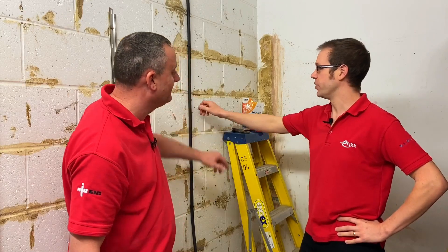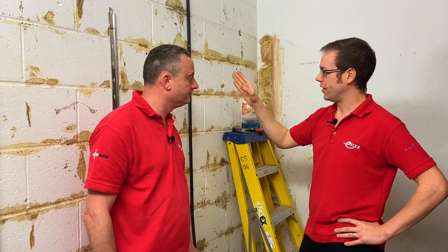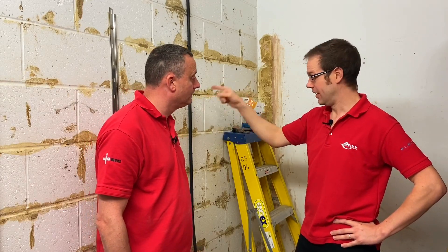It is super tight to the surface, super held in position — hence it's the super clip. If I'm installing a steel armoured cable on the exterior of a building I'd choose that over the traditional cable cleat. People tend to over-exaggerate the fixing with penny washers, whereas the super clip just blends in — almost disappears. Just that little ring of metal around it makes it look so much neater. It grips the cable, it's nice and straight. That is what an externally dressed cable should look like, and for me it's the Linnian super clip every day — the one that blends in, super secures it, and is faster to fix. No downsides.